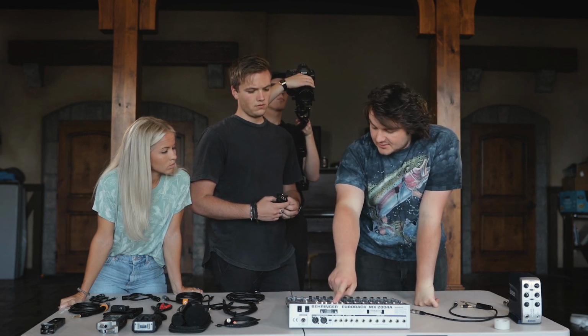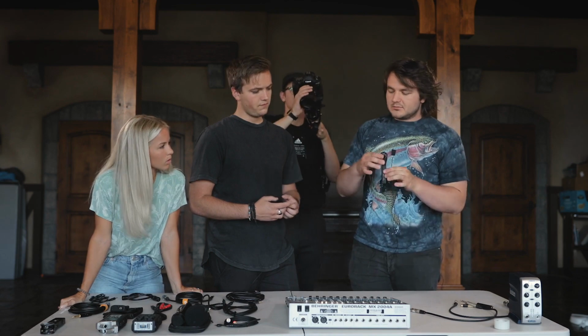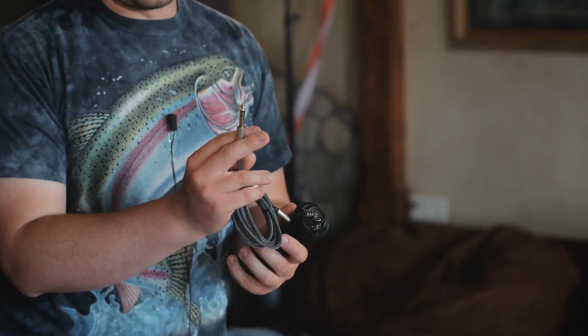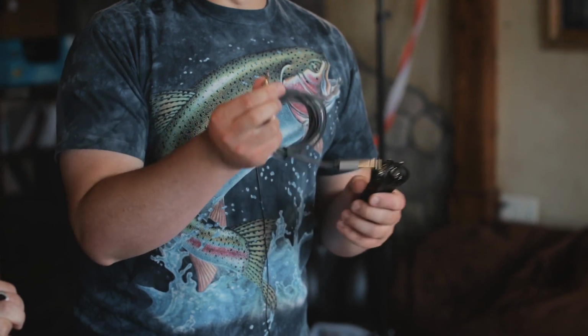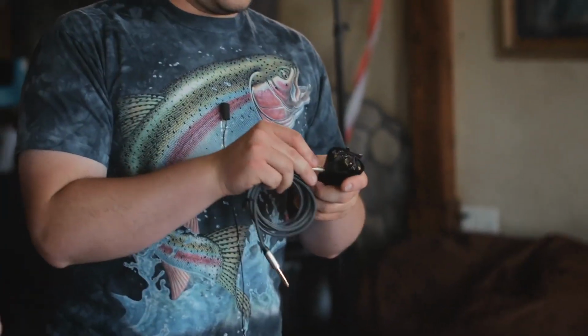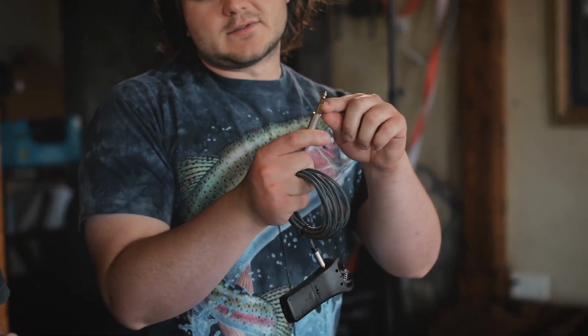Almost always that aux send is going to be a 1/4 inch. So if you have a H1, you'll need your 1/8 inch, which you plug into your mic in, to 1/4 inch, that's the bigger one. Oftentimes this is like a headphone or your phone, and then this is like a guitar cable or an instrument cable, okay? And you'll want to do TRS when you order them. That's the 3 or the 2 bands, okay?